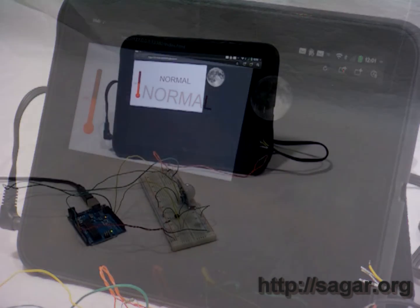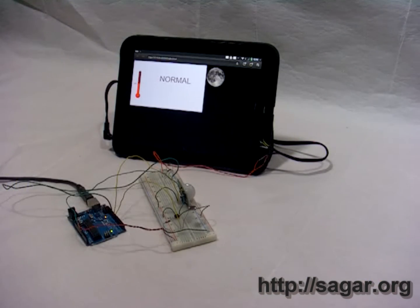So there it is — a simple way to communicate with an Arduino. All it needs on the Arduino is an IO pin to provide a digital signal compatible with the audio input of any device that runs Linux and has a headset jack. In this case I'm using an HP TouchPad. The code running on the tablet side is just standard Linux talking to ALSA, and then a very small HTTP server that serves the UI. I'm using a web browser for the UI, which makes it very simple, and you get the full advantage of any HTML assets you want to use. With current HTML5 capabilities, you can do an awful lot, as I've shown.